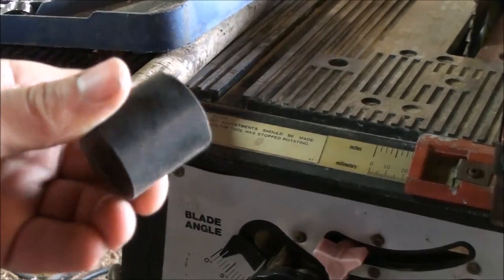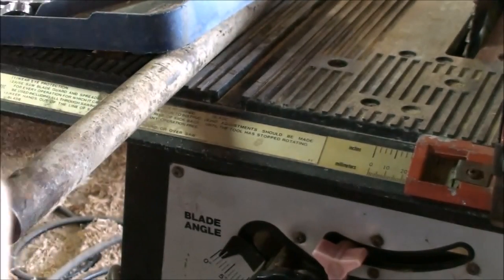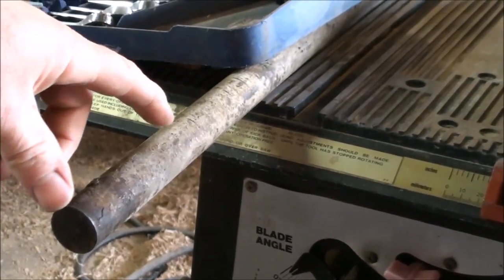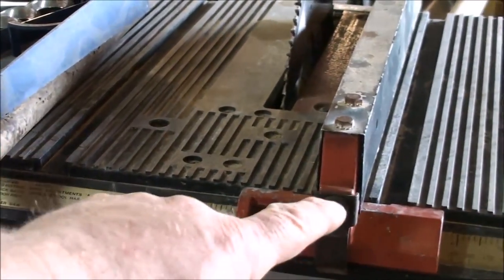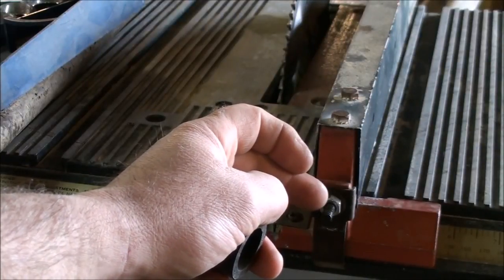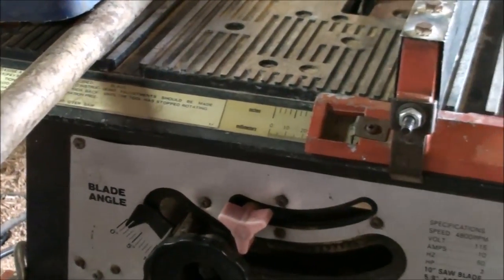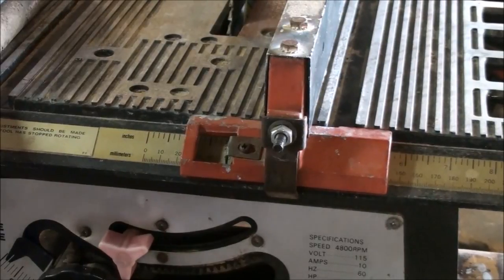I may put this little rubber deal on there just for comfort and control. I just found this laying around — I don't throw anything away — and I said it looks like it would fit on a one inch rod, and sure enough it fits right over top. So my intentions are cutting this off about four inches, then I'll run a tap in there to match this thread size, and basically I'll be replacing this nut with a hand-operated nut. Just hand tight will suffice — you don't have to really reef on that to get it tight. So that's the plan. My first order of operation is to take this out and go ahead and cut it to length.